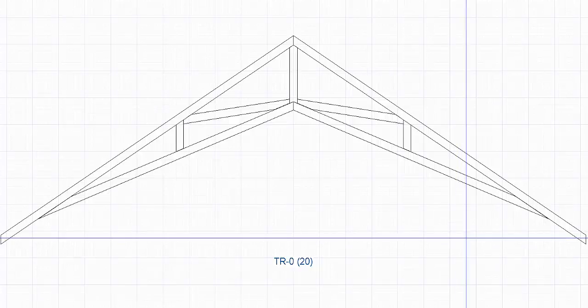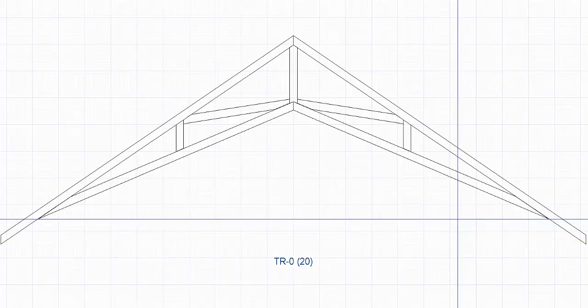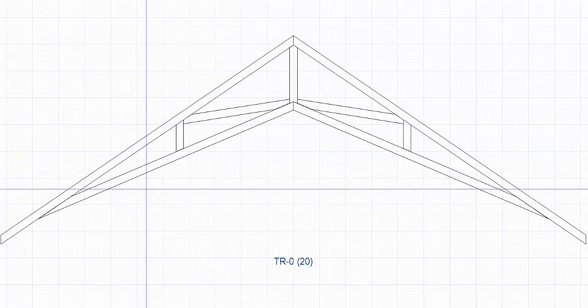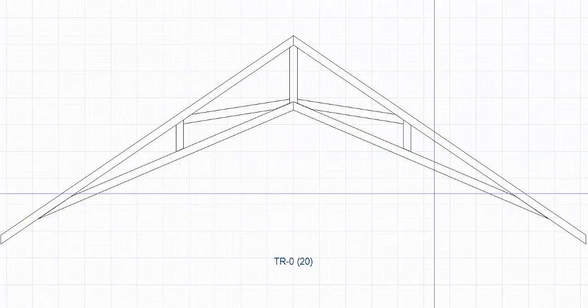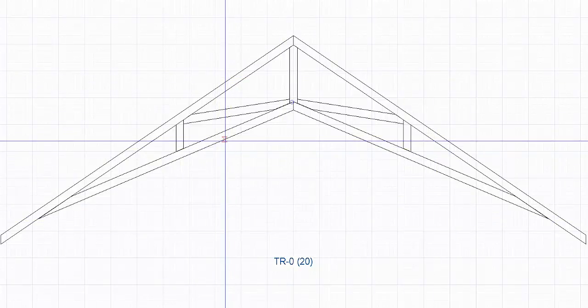The truss manufacturer obviously will engineer and certify the trusses, but if you look at that horizontal line, that's approximately where the top of the wall would be. And you'll see that you have this whole area right in through here that would be open. The top pitch is an 8/12, bottom pitch is a 4/12.